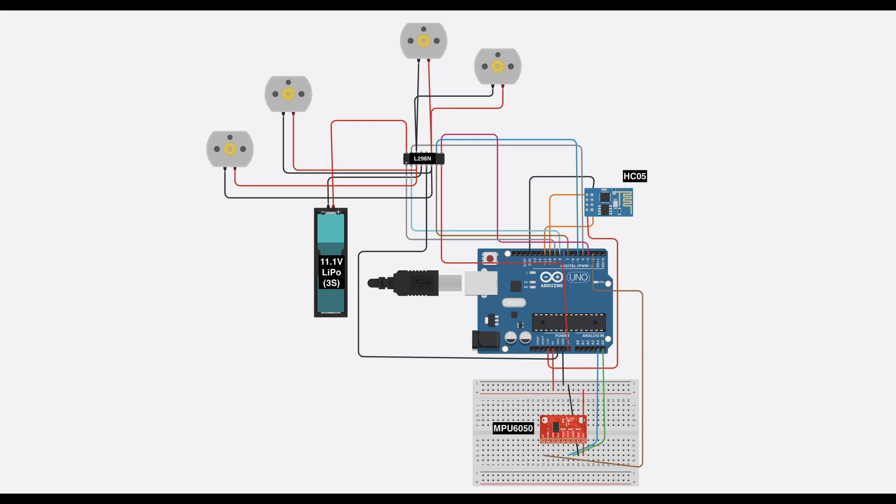As you can see, the way you connect these components to the Arduino is quite standard. I will put links below on how they should actually be connected. In this diagram you can see that all these components have a common ground on the Arduino itself. I have my HC05 connected up here to pins 10 and 11. I do not use pins 0 and 1, because that will interfere with the serial port. My transmitter and receiver are pins 11 and 10 respectively.